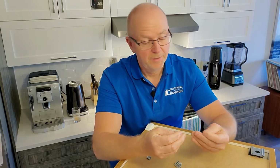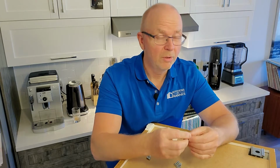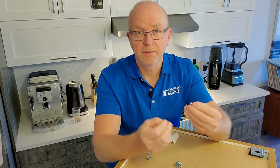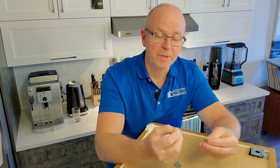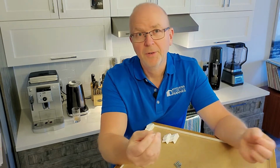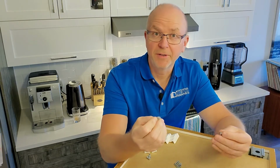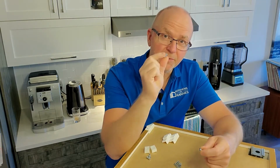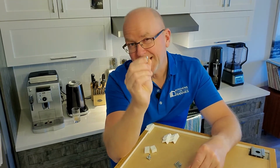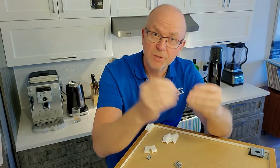If it's from a production point of view, I doubt that. If it's because you think it will go easier in the hole, it will not. And if it's because it's hanging any stronger than the old one, I don't think so, because out of the 150 kitchens I have installed, that is, I don't know, 2,000 or 2,500 cabinets, as far as I know, none of them has fallen down yet. It's as good as the old one, but a tiny bit more difficult to get to grip into the hole. So I don't see the point of this one.